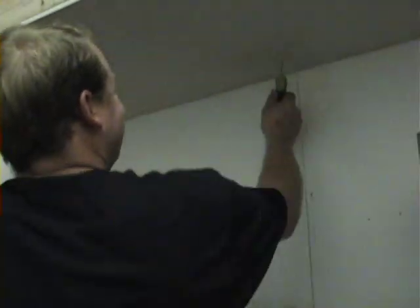The ductwork we're using is 6.5 inches in diameter. We've got where we need to cut our hole marked out and ready to go. One thing I often tell people is know what will cover, know what won't cover. There's no need wasting your time being very exact for an area that's going to be covered up later by future work.